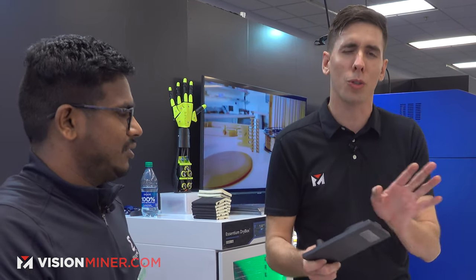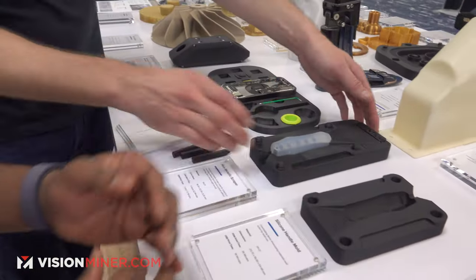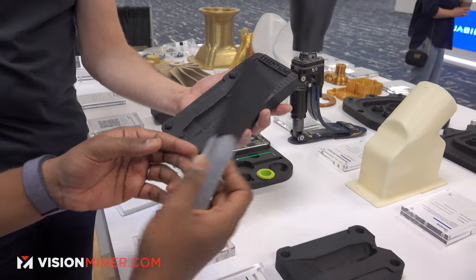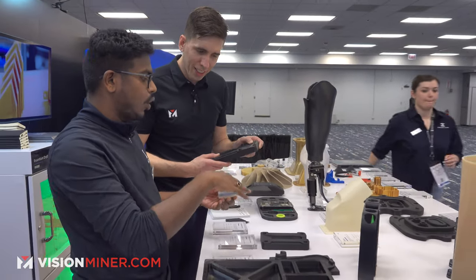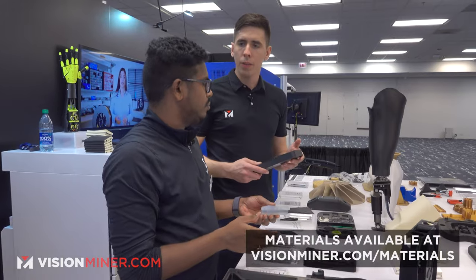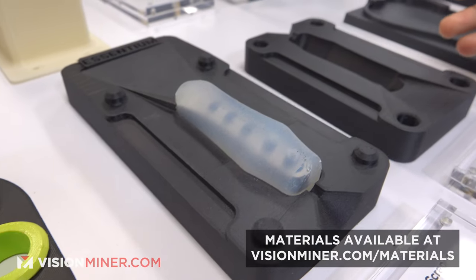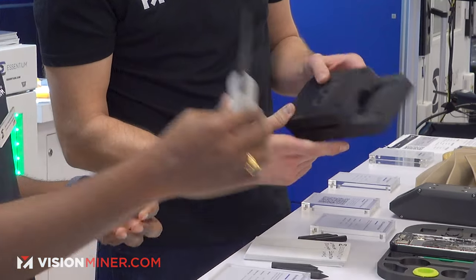That phrase is interesting because it's not like aluminum in every way, but it shares some properties — cool tagline. These are more molds. This kind of vacuum forming is cool, but compression molding is also interesting — like this soft handle. The challenge with this kind of material is you want very easy release, so you need a chemically resistant material. That's where polypropylene comes into the picture. It is highly chemically resistant and doesn't stick to anything, so your molds come off very easily.